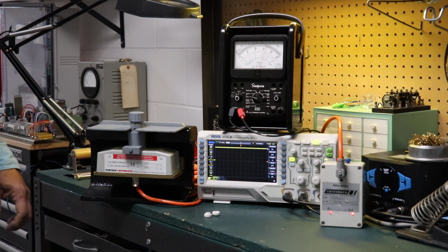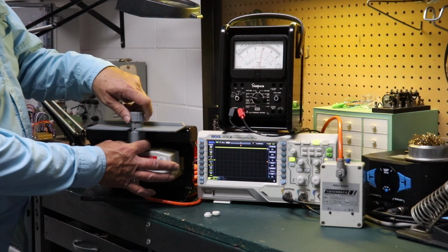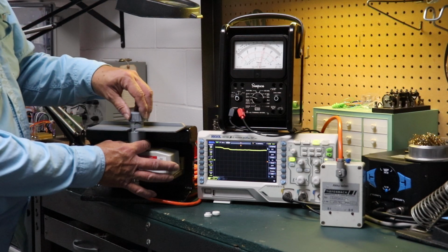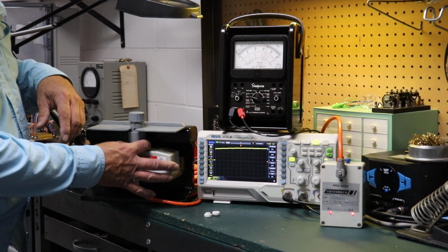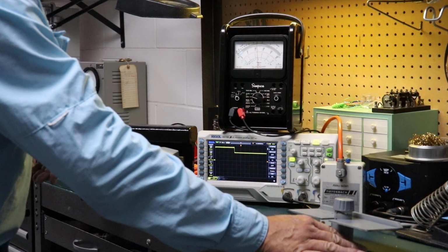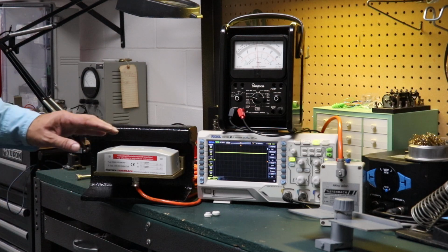Now I can go ahead and back this off. You'll see it change, right? Red LEDs go out. I'm going to bring it back, and they should turn on at roughly the same time. So they both turn on at 45 millimeters. So you can kind of see how the sensor behaves.